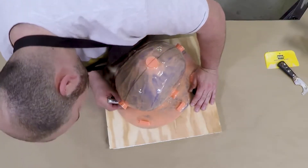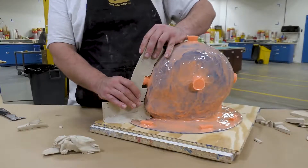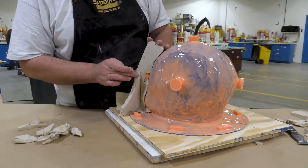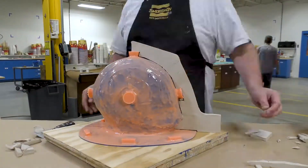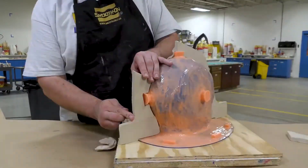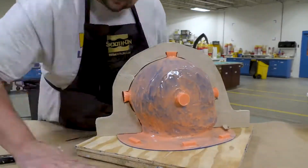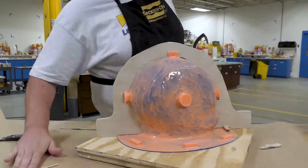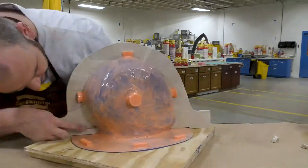This split should be right in the center so that you don't have any interlocking undercuts where the support shell can get caught up on. To separate the two halves and build up our support shell we're going to use Sculpey soft clay to do the separation wall. This material is really easy to work with and you can maneuver it really easily to create very clean surfaces. All the gaps between the silicone mold and the clay build-up should be closed and clean.